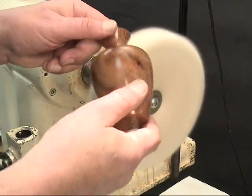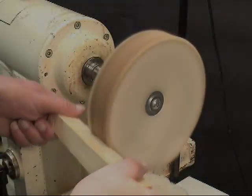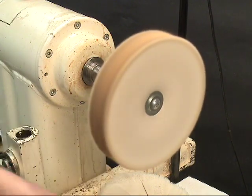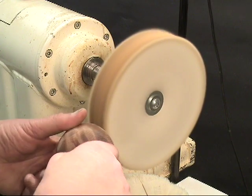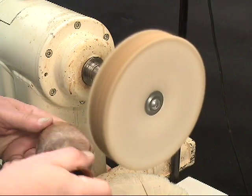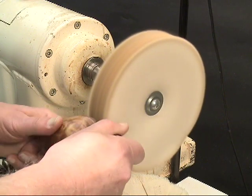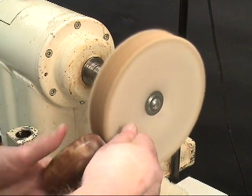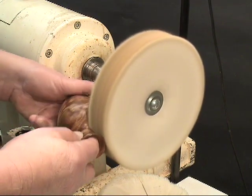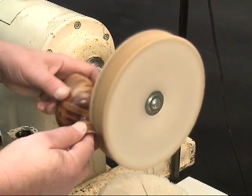If I want to do another coating of wax, I'll leave it sit overnight and come back and give it a second coating. Now I'm going to do the same thing with the other piece — clean the wheel, charge the wheel, and buff the wood. This piece has a finish on it, so the important thing is that the finish be dry. We need to always make sure that finish has had plenty of time to cure. This is an oil finish, and it was put on by soaking the piece in a bath of oil.